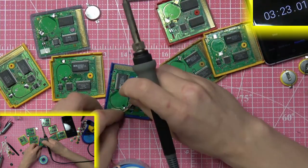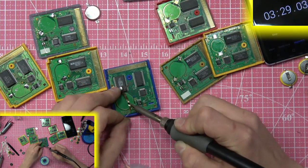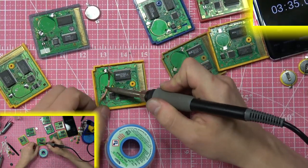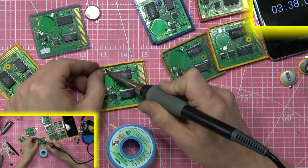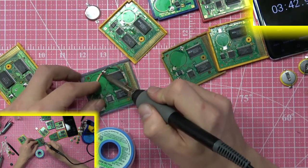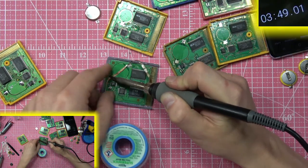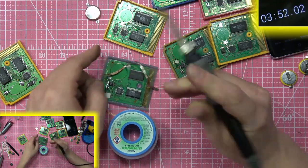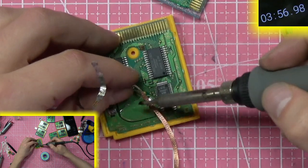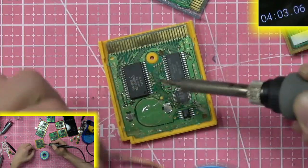This is basically like a regular video of mine but with a stopwatch to add the intensity element. Whenever you're removing solder with wick, I always find adding a little bit of flux dramatically helps — it makes the solder stick to the wick better and transfer to it. We're at 3:45, and we've got one more to remove with the wick.